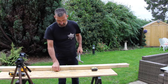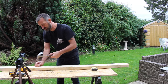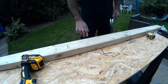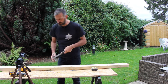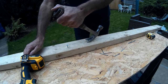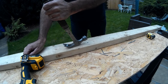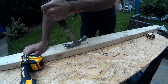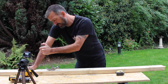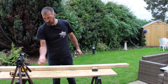Now the claw — that's very useful. Let's say you've hammered in a nail and it's not straight or it's in the wrong position. What do you do? Reverse your hammer grip, and that's when you bring the claw into the nail head. It's for removing nails. Bracing the timber with your other hand, you just pull back — I use little jerks like that — and out it comes.